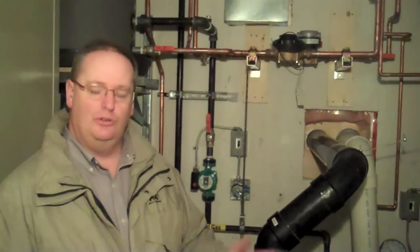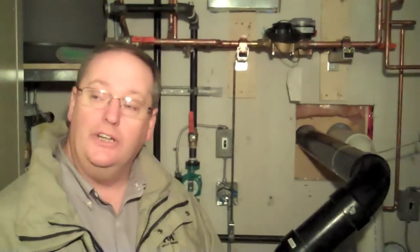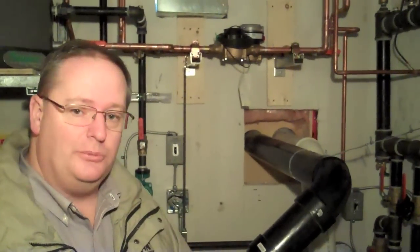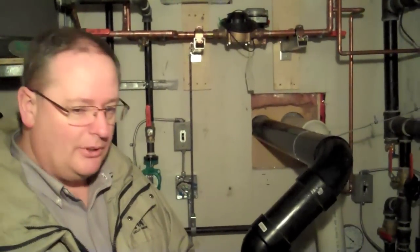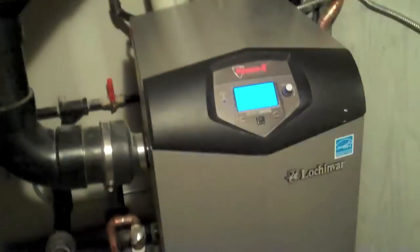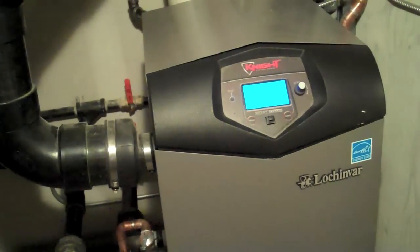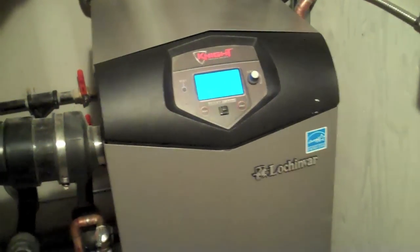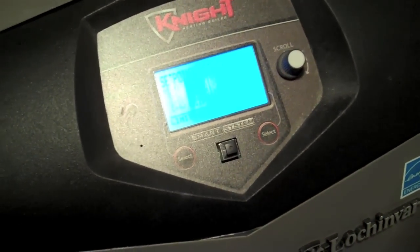This boiler has the ability to recognize each individual zone, as Devin mentioned earlier. So we can recognize the in-floor zone at one temperature, a heat exchanger zone at another temperature, and the third being the baseboard, with the intention of running itself at the lowest possible temperature to save money and give the best comfort to the fine people at Controls and Equipment. The boiler operates anywhere from 20 to 100% of its actual capacity. Right now it's resting. It was turned on today and we're already up to temperature in most of the zones. It can operate as low as 45,000 BTU.